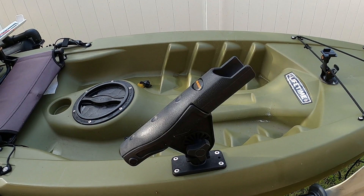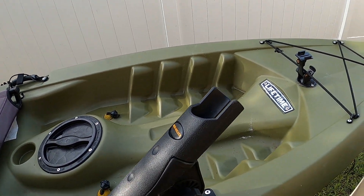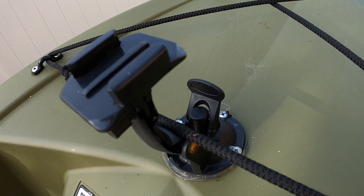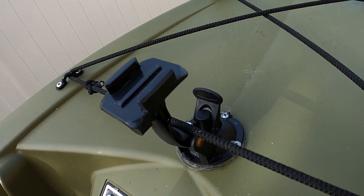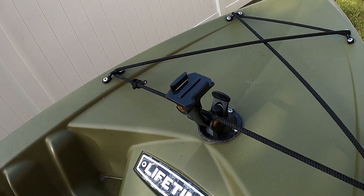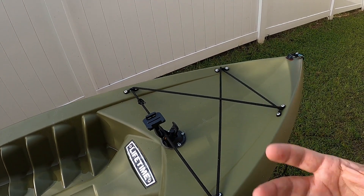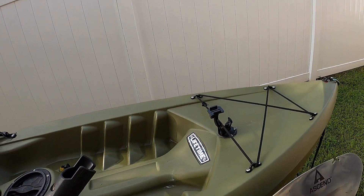I haven't added any other rod holders up here because I haven't really needed them except for that one rod. For the camera, I just took a cheap suction mount — not a GoPro one, just an aftermarket one you'd get in a pack online, about $16 to $20, with a bunch of other accessories included. I mounted it right here, put a bunch of goop under it, and screwed it in with self-tappers — it holds really well. The only problem is you hear everything on the hull: any hull slap, anything you drop, it picks it up very well.